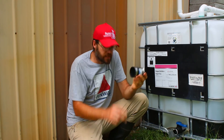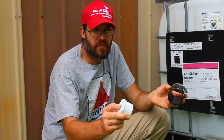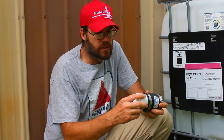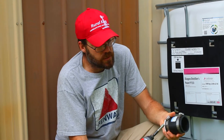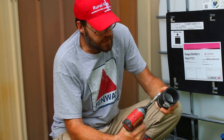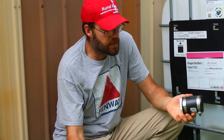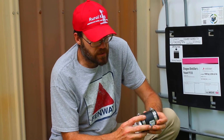So you're going to need three things. You're going to need this — the two-inch to three-quarter-inch threaded adapter I showed you earlier. You've got to loosen up one side of the hose clamps. The hose clamps on this one take a five-sixteenths nut driver. Just tighten that up — don't tighten it too tight. There's not a lot of pressure on these systems, so you don't have to go crazy on it.